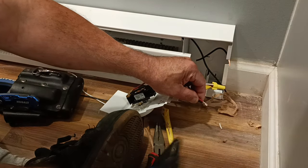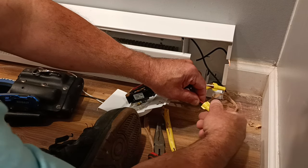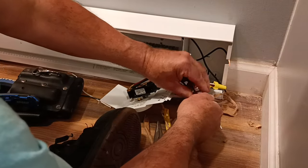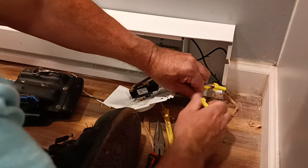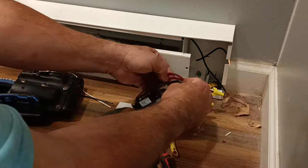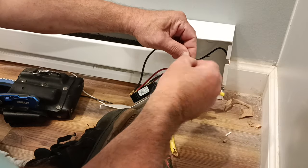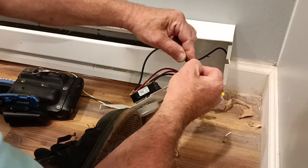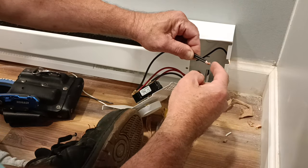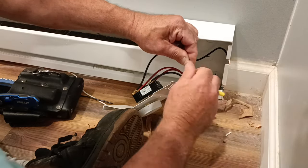I'm going to go take the covers off, both of them off there. Okay. There we go. There's even. Make sure it's tight. Our insulation is going down in our wire nuts. Now our black wires coming back from the thermostat are going to go to our two black wires on the heater. Now these are looser strands, so I'll wrap them a little bit here. Get them sit there. Even on the end here. Copper even on the end. Insulation even on the bottom. Put our wire nut on. Make sure our insulation is going up into the bottom of our wire nut.